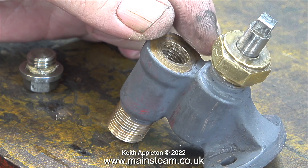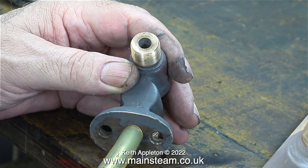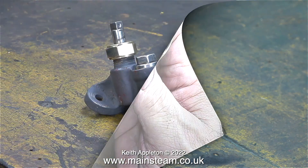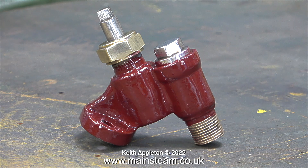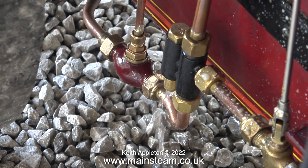Here's a clip from the episode when I was modifying this check valve. After truing up the seat with a steel ball I refitted the phosphor bronze ball as well as modifying the casting to be a better fit on the boiler bush. When I tested it with compressed air particularly from the other end, the ball lift seemed to be a little bit too much. The ball is moving into the upper part of the check valve and partially blocking the hole through into the boiler.